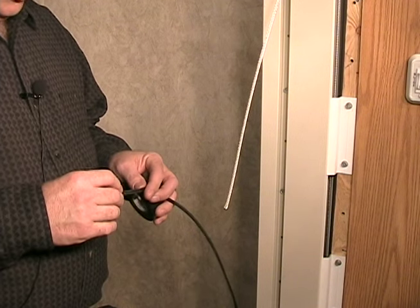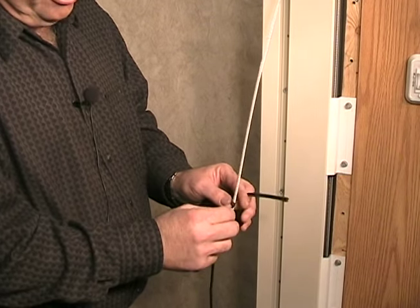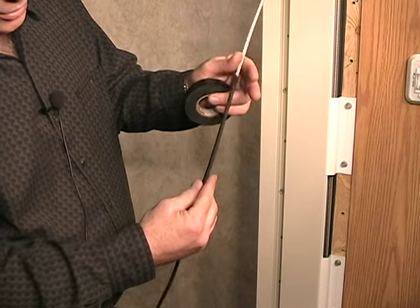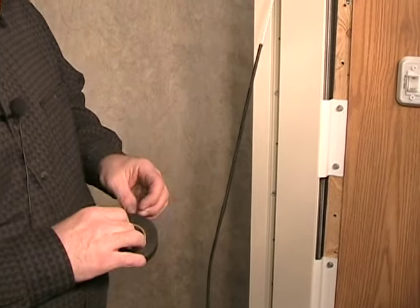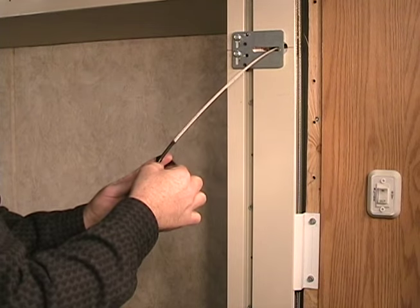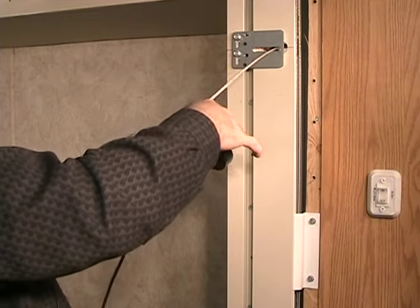Now you can pull the cable towards you to get as much cable as you need to put on the wire mesh wrap. The nylon mesh used to repair cables with our cable kit is like a Chinese finger pull — it's a compression-type, weave fitting. Tape off the end of the cable you cut to make sure no loose strands come through the wire mesh and poke a hole in your finger. Make sure you only put a small piece of tape so you don't have a big bundle at the end. Then slide the mesh on to about halfway, or as far as you have access to. When taping the wire mesh, start about three inches down and wrap it in a long spiral so you do not wrap tape over tape, but tape over the mesh, so as not to build up the outside diameter of the cable any larger than necessary.